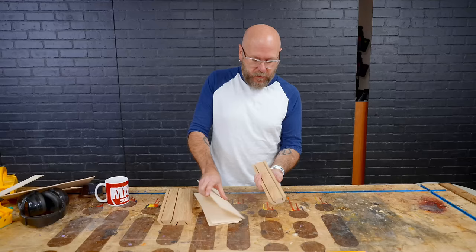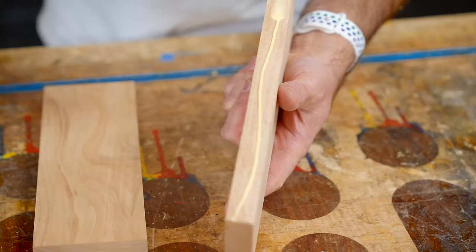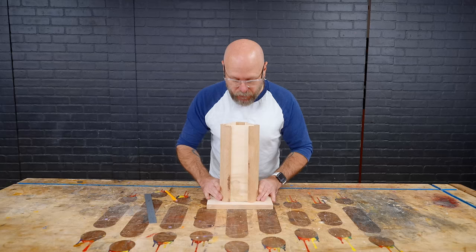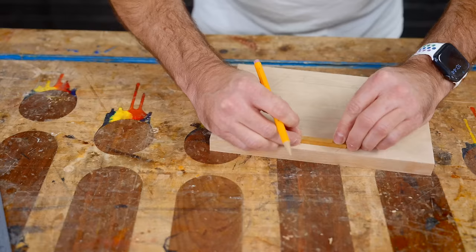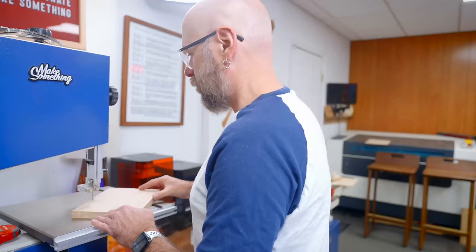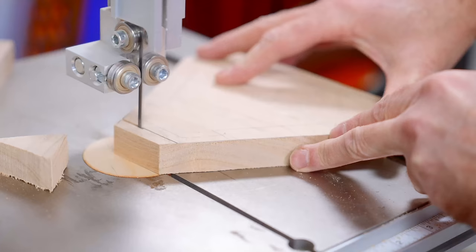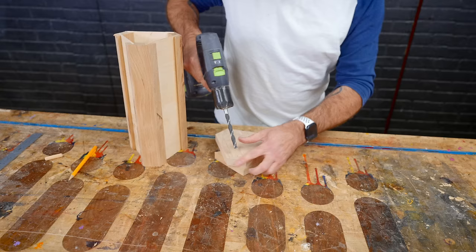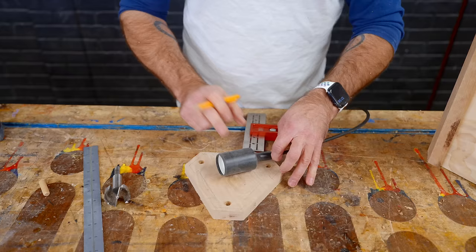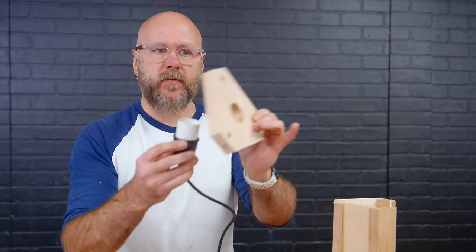So I'm going to temporarily put this together and now we can use this to draw our bottom. I don't have a piece wide enough for the bottom, so I'm going to glue two pieces together to make it wide enough. Now that the base is dry, I can set this on here, draw the outline, add a quarter of an inch to create a little lip, and then we'll go cut this out on the bandsaw. We're going to use some dowel joinery to connect the base to the top, so I'm going to drill some holes in here. Now I need to drill a hole for the lamp, so I'm just going to find the center here.